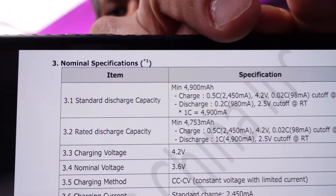If you look up at the top, it says 0.5C. Everything is based off of 1000 milliamp hours — so 1000 milliamp hours, one amp hour, you can charge at one amp. If you have a 0.5C, 5000mAh cell, then you can charge it at 2.5 amps per cell.